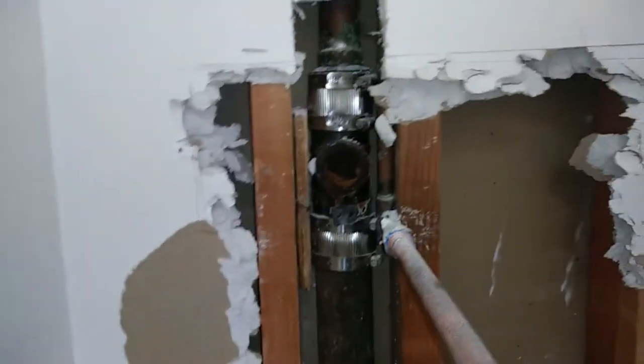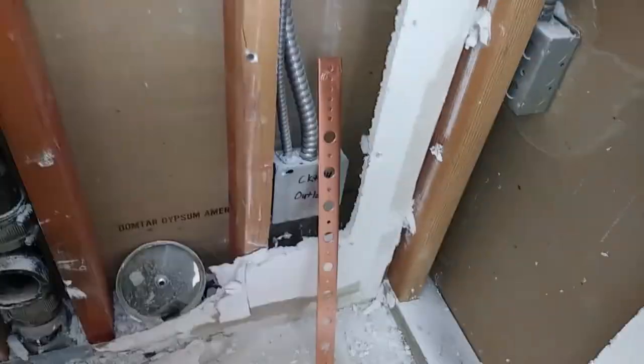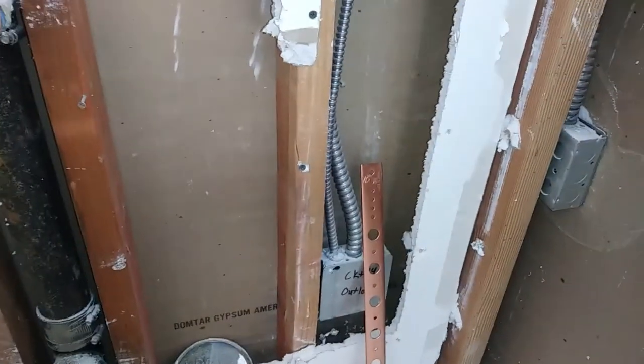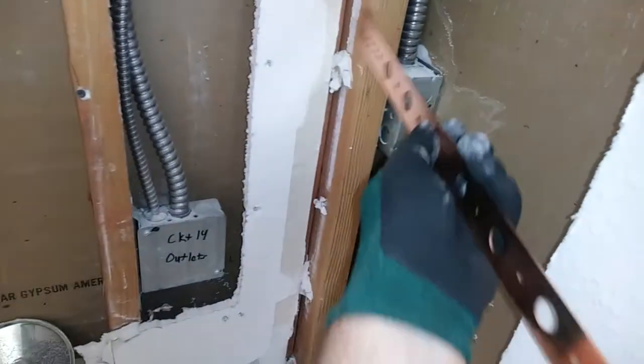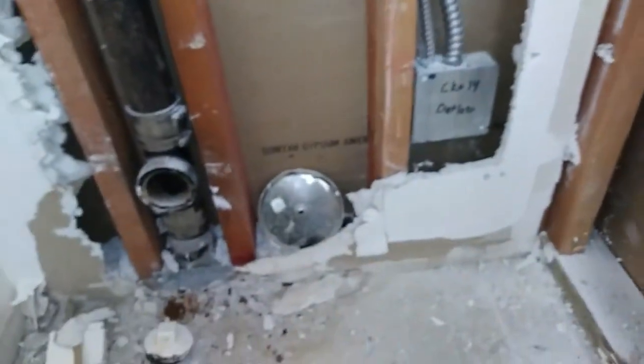This is cold water — pretty sure it's cold, uninsulated anyway. We'll investigate that. We've got cold water here already. Going to drop the hot down from above, through the ceiling tile, probably just strap it to the wall here, then obviously drop it down to the right height and elbow it in. I've got one of these plates to hold everything, which slides behind there pretty easily. I'm going to get that started next, starting with getting this funky old cast iron out of here.